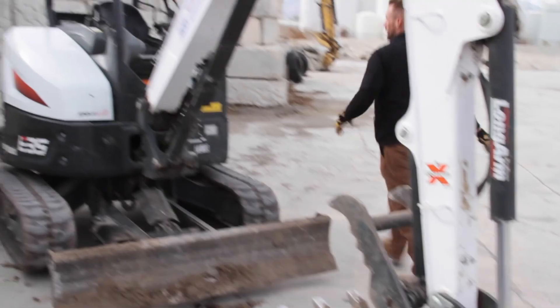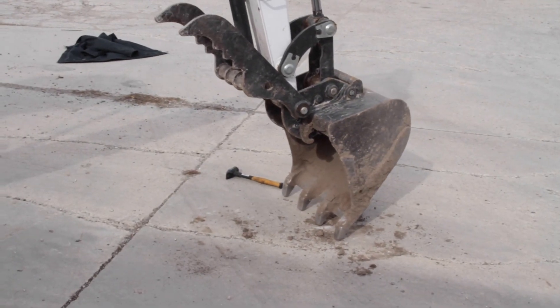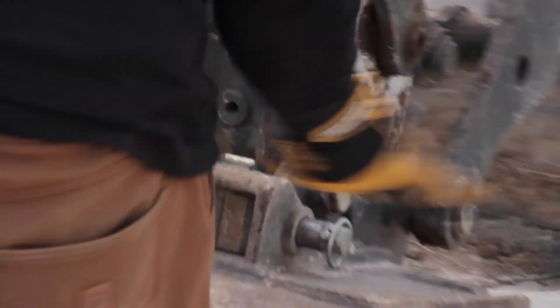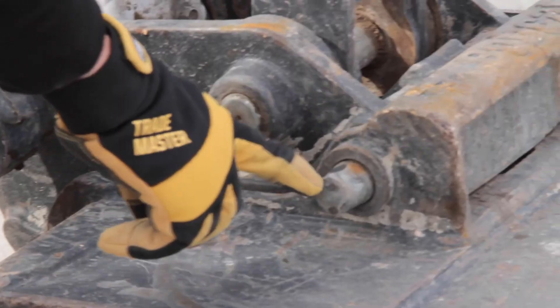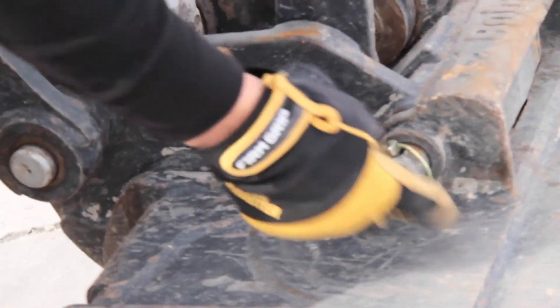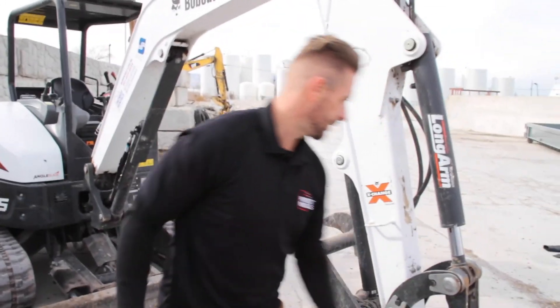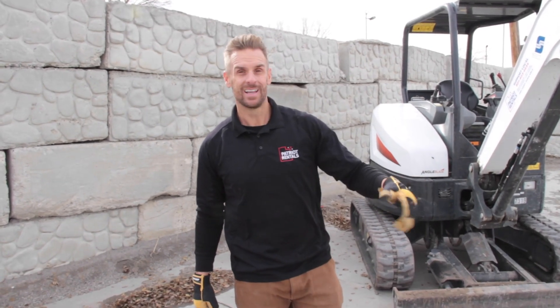Make sure we get it all the way through. Release some pressure off of it and switch over — I change my bucket pressure to this because I'm more comfortable this way. Get out, grab my hammer again, hit it through just like that. Now my hole is exposed over here at the top and my pin goes in. We used a thinner pin today just for filming purposes. And that is how you change the bucket — whether it's a 12 inch, 24 inch, or 36 inch bucket — that's how we change them on the Bobcat E35.